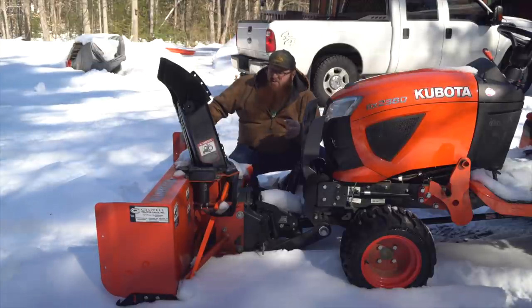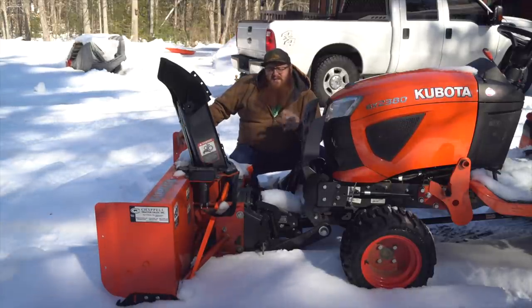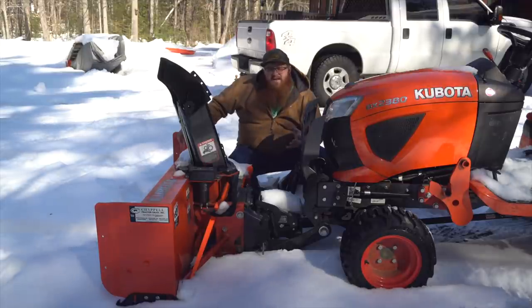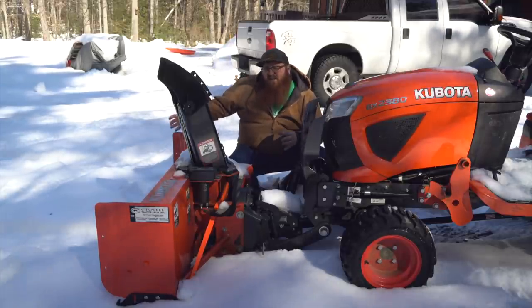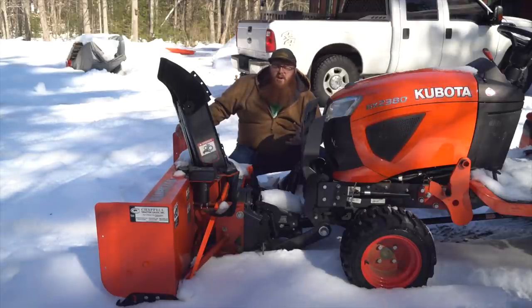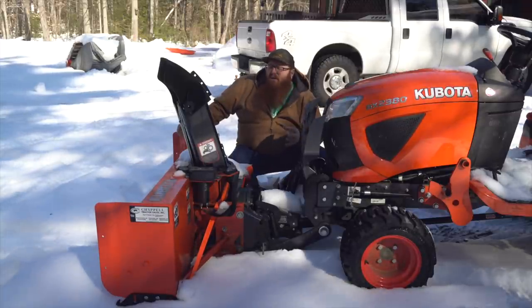You're going to have two main variants of front mount snowblowers. First are snowblowers that attach with a skid steer quick attach. These are designed for skid steers, but on larger tractors with greater front lifting capacity, you can also run these skid steer quick attach snowblowers if that tractor has a skid steer quick attach on the loader. By and large, all skid steer quick attach snowblowers are going to be run hydraulically, so you need to make sure your tractor has front remotes with enough hydraulic flow to run the snowblower. A hydraulically driven snowblower is a hydraulic fluid hog — it needs a lot of flow to keep things going smoothly.